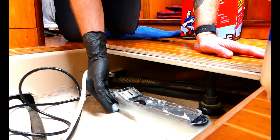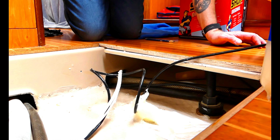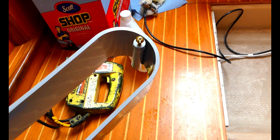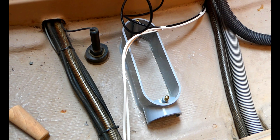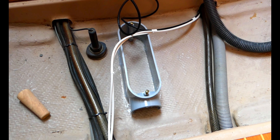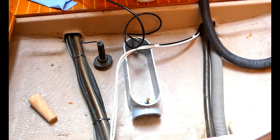Here was the test location to make sure the transducer would read through the hull. We got the bottom cut out and used a bit of the scrap to make a little filler for the inlet. We'll land that in there, epoxy it to the hole, let it cure, fill it with Vaseline, and sink the transducer back in. I've epoxied in the conduit fitting that will be the enclosure for the transducer — two applications of epoxy, still curing — and on the outside I backed it up with some silicone. We'll let that set up, do a tidy-up, put the petroleum jelly back in, drop the transducer in, flash up the chart plotter, and see if we have winner winner chicken dinner.